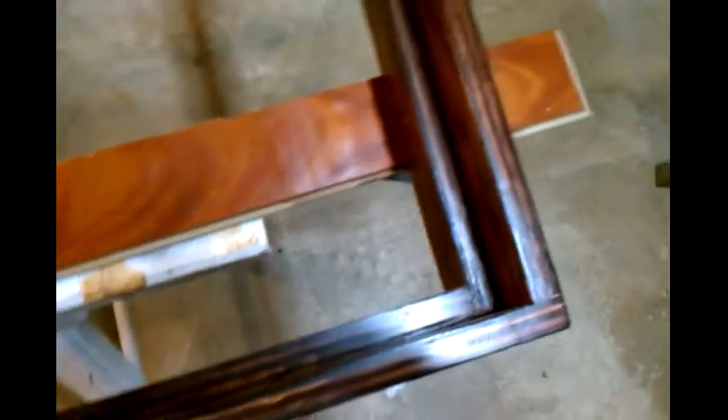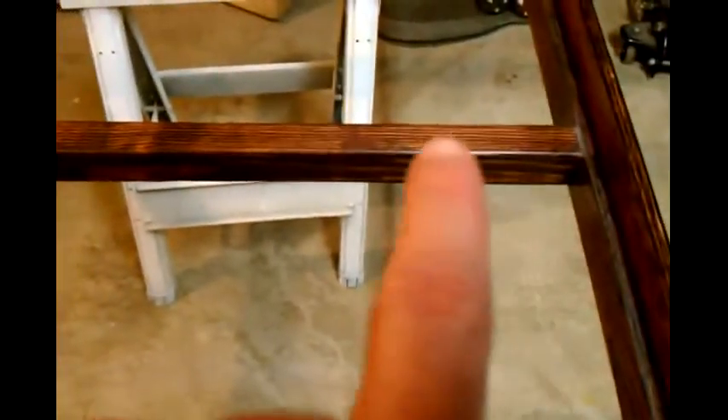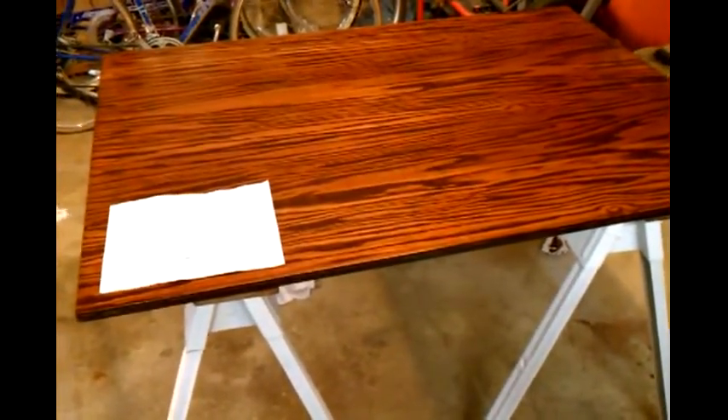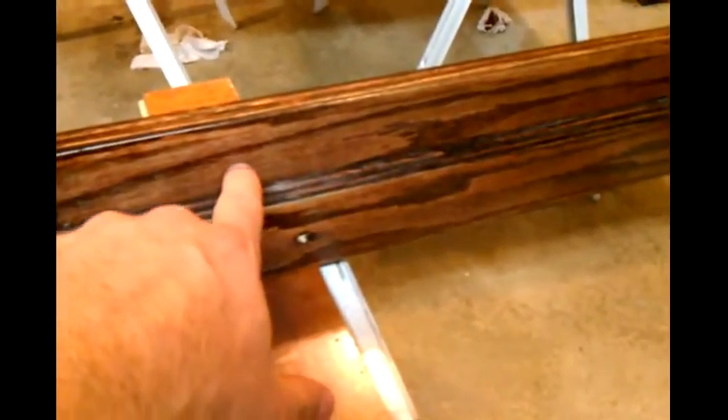I basically just put the little frame inside the big frame, then glued and nailed them together. You can just use a 2x2 across the middle — probably doesn't even need that. I used 3-quarter inch plywood — oak, basically oak and oak plywood. The finished plywoods I had to choose from were all about the same price, about 40 bucks. Maybe if you've got some extra wood you could 2x4 it and dado it or whatever. But we wanted a lip, so the plywood sits here and there will be a little lip.